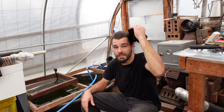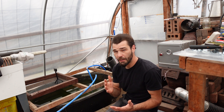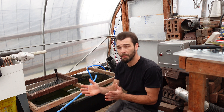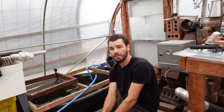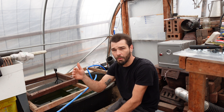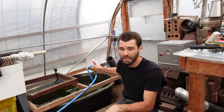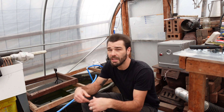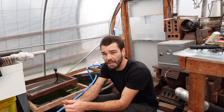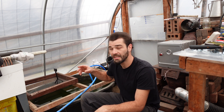We had to do some troubleshooting on our solar-powered systems. One of our solar systems was only feeding energy to its battery. It had a bad battery over the summertime and I didn't catch it. We got a new battery and threw it onto the system, but we never unplugged from the solar panel. So it was still reading an error and never lost power. To reset the solar controller and start getting energy drawn from the battery to the 12-volt output device — either a pump or a fan — you have to fully unplug, then plug the battery in, then the solar panel.